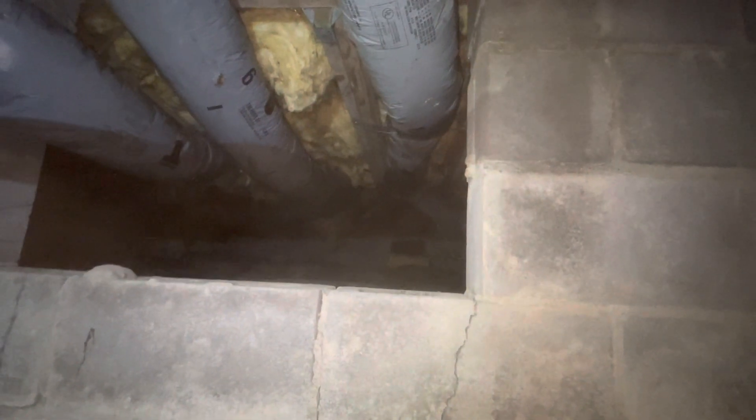This is the entrance to the back room, furthest away from the driveway — same exact story with the discoloration on the joists and the insulation falling down. This is a little unusual: on these joists it looks like there may have been a prior repair. I think that original joist is held on with a joist hanger, and beside it is another joist that looks newer and I'm not sure how it's attached, if at all.